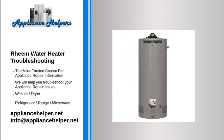Electric supply may be off — make sure the electric supply to the water heater and disconnect switch, if used, are in the on position. The thermostat may be set too low. Check for leaking or open hot water faucets and make sure all faucets are closed. Electric service to your home may be interrupted — contact the local electric utility.